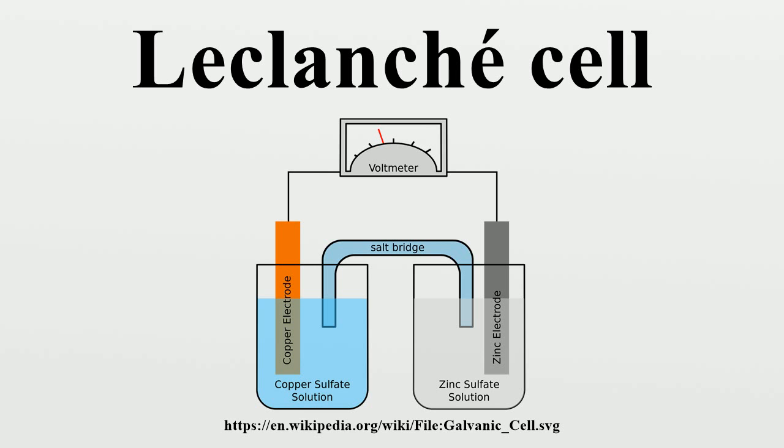The chemical process which produces electricity in a Leclanché cell begins when zinc atoms on the surface of the anode oxidize — i.e., they give up both their valence electrons to become positively charged ions. As the zinc ions move away from the anode, leaving their electrons on its surface, the anode becomes more negatively charged than the cathode. When the cell is connected in an external electrical circuit, the excess electrons on the zinc anode flow through the circuit to the carbon rod, the movement of electrons forming an electric current.